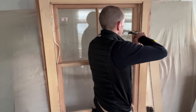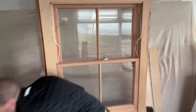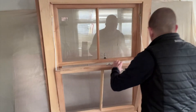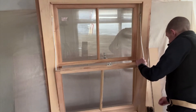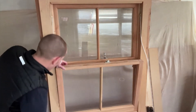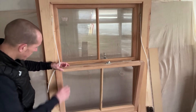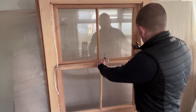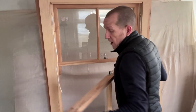Pull it down and pin it in. On this sash, the sash cords are screwed in — that's just how we do it in my sash window business — so we're going to ease that out and undo the screws. You might find — in fact you probably will find — that there's nails in there. If there are nails, just get some pincers and ease the nails out. There'll probably be like four or five nails. Then just take the bottom sash out — easy as that.